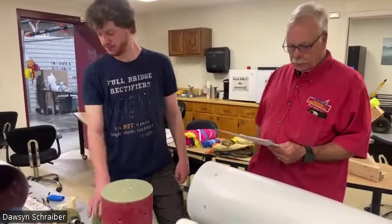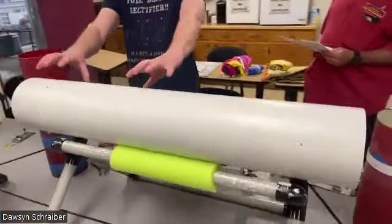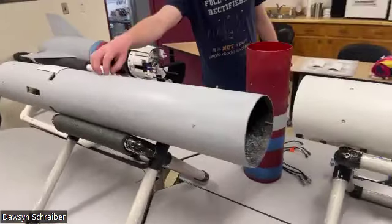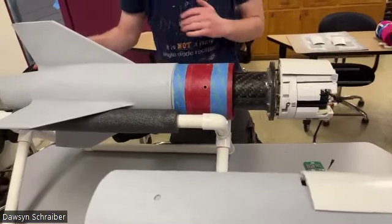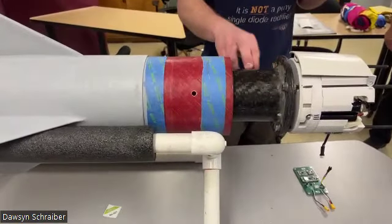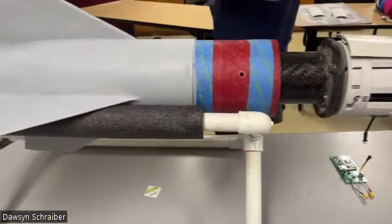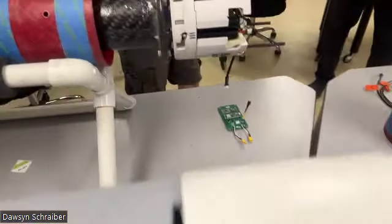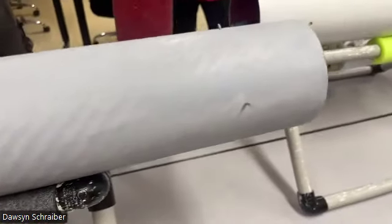Let's go to the body tube, material composition. This is also Wildman fiberglass for the main body tube. From about midway down, it's all student wound carbon fiber tubes. So like this one here and this section is all student carbon fiber. Let's see, we got some motor tubes in here as well. They're also student carbon fiber. But basically, from midway up is fiberglass, and from midway down is carbon fiber. No 3D printed, so this is SRAD carbon fiber filament wound. Yes. Hand laid up, structurally sound.